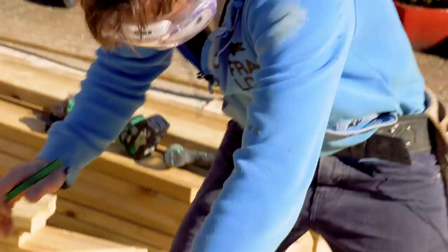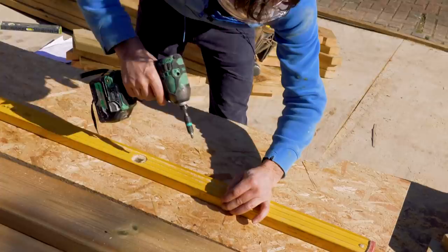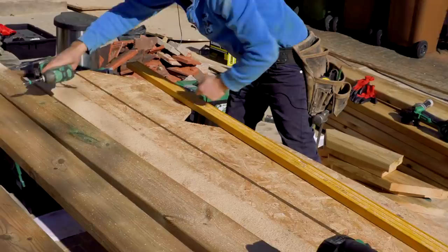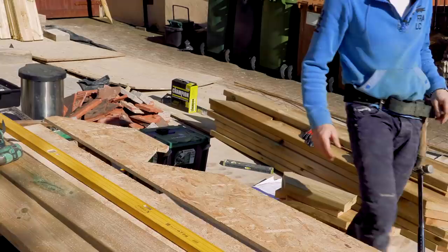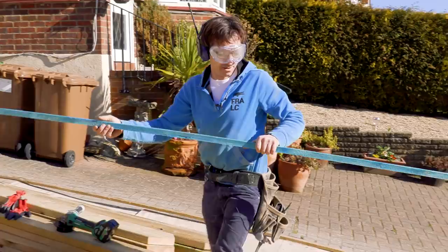I've reduced that down now to a more manageable size. Notice my sight rail saw there - obviously a level, couple of screws, that's all you need for a perfect straight cut. Now I'm just going to fix a baton to the rafter line - two small bits - because then it won't catch all the way through.